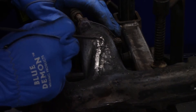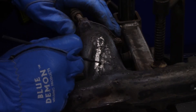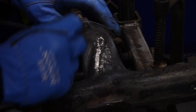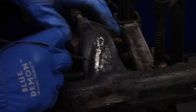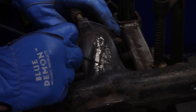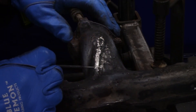As you can see, right here I think there might be just a little bit of underfill right there in the little groove — must not have gotten that edge really well, but as soon as I clean that up more I'll be able to tell. But other than that, over here to this side, slag came off real good. Really good fill down here. Actually really happy with this repair. We'll get down and check this other side, but if that is good, then the repair is done.